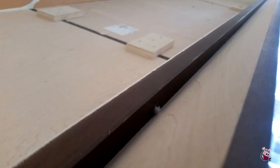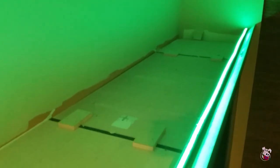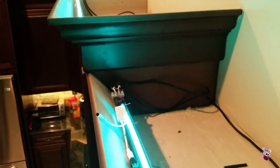This particular cabinet set had some molding on the front. The molding was mounted on a board which extended up behind the molding. We decided to mount the lights directly on this board — which is in really good condition, a nice flat surface — to move the lights away from the wall and help cast light onto more of the ceiling than the wall, which was not white.